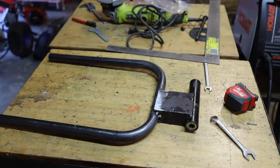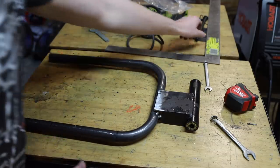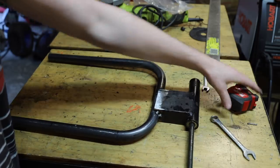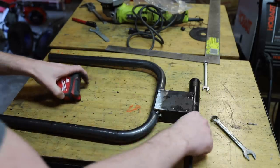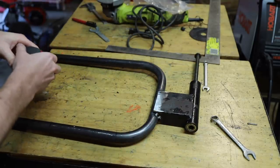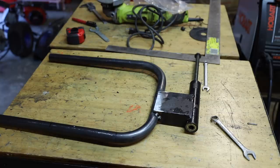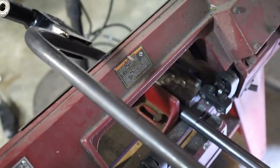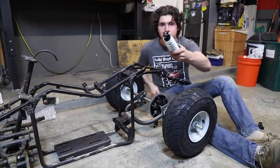It was really difficult to figure out what point was square so we could have the axle bearings welded on straight. What I did was put a bolt in and measure from my mark to the inside edge of the bolt, which put us right at 13. I did the same on the other side and also got 13. So I'm going to cut it right at the end and butt up our axle hanger from Go Power Sports and weld it all in.